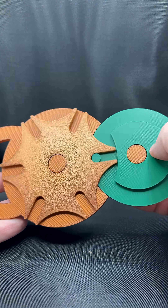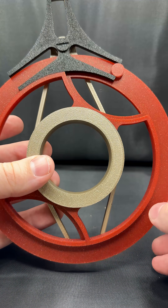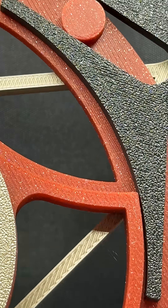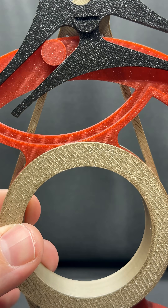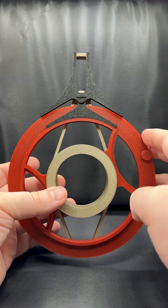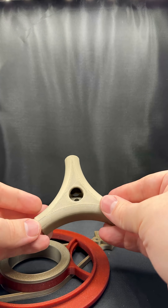For most of the time when this red disc is rotating, nothing happens. When it gets close to the top, it will enter into the fork of the Geneva mechanism and pull the mechanism along with it exactly one-third of a turn, and then the process continues. This transfers constant rotation into intermittent rotation, and this type of mechanism is really useful in manufacturing.